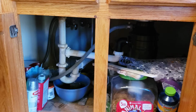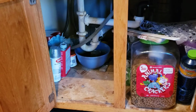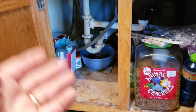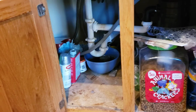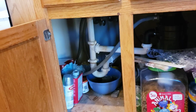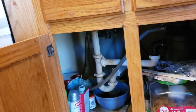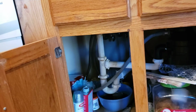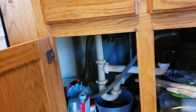The front of this is a loose piece. The floor is a 4 foot by 4 foot loose piece. And we're going to need some 2x6s and 2x4s for framing to actually build a floor for that to sit on. This is an older way of doing it, but because of where the plumbing and stuff is, we cannot use a single sink base or a compartmentalized angle sink base. They're kind of a diamond shape. They will not work in this application because of where the plumbing's at underneath here.